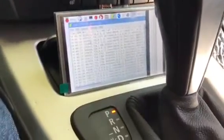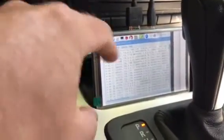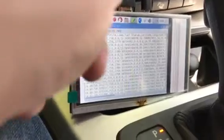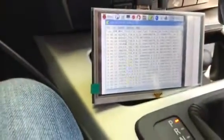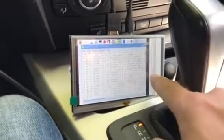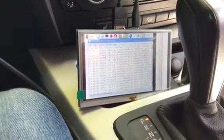So just a quick video showing what's going on. If you look on Amazon, it's about $35 for this LCD. It does have a resistive touch screen if it's plugged directly into the Pi. It does work even if you don't do any configuration on the Pi. If I take this HDMI and plug in a TV, I'll get full HD; if you plug into this monitor, it only does 640x480. If you modify the config.txt file in the root of the folder, you can force it to 800x480, which would fix the right part of the screen. But this is enough for me to use and I don't have to mess with the configuration for now.